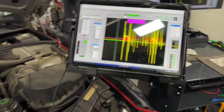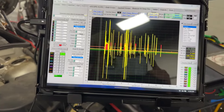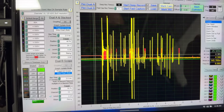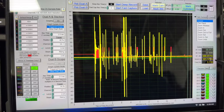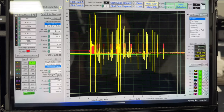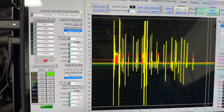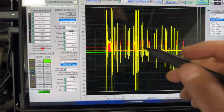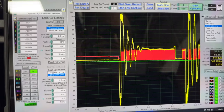We can see some actuations happening and it's almost matching. I'll stop and save this data. Looking at the capture — angle-wise it was kind of okay, but I want to see the amperage. Definitely very high — we're getting spikes of 55 to 56 amps. That's very high consumption. When working normally these motors run around 35 to 45 amps at most, especially when moving.